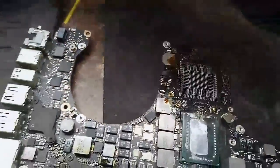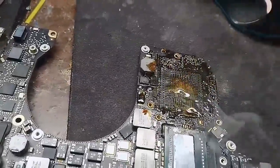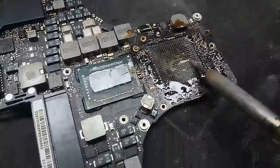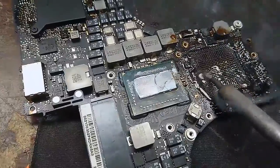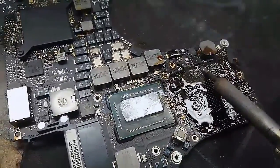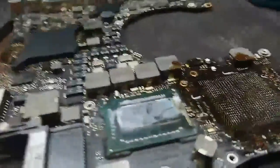See that surface — that's not enough flux. Get more flux, put it on there, make a big-ass lake of it. Now while the board is still hot and smoking, you can take your soldering iron and just run it around on the pads. See, that's getting the majority of it — it's accumulating on the tip of the soldering iron. As long as the board is hot you can do this quickly without ripping a pad off. See, all that globbed up on my soldering iron — that's like 90% of it right there.